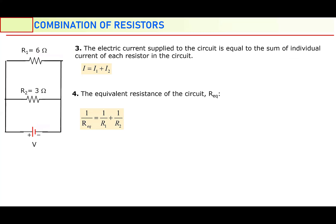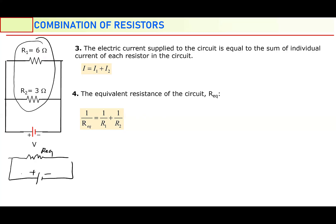Last characteristic: equivalent resistance of the circuit. These two resistors can be represented by a single resistor, called the equivalent resistance of the circuit — R equivalent. In series, equivalent resistance was R1 plus R2 plus R3 plus R4. But in parallel, one over R equivalent is equal to one over R1 plus one over R2 plus one over R3, and so on.